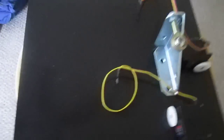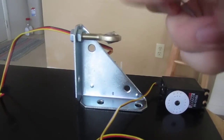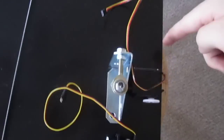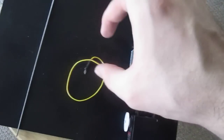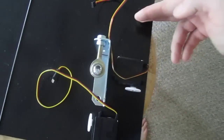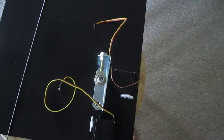Here's the plastic piece I'm going to cut for the base. I'm having a hard time envisioning this in my mind, but I figured I'll have the head-nod servo here, the throttle right here, and the linkage coming off like this. I'm going to cut the acrylic in a rectangle so that the angle bracket is dead center, with room for the width of a servo on each side and on the front, and one position in the back as well.